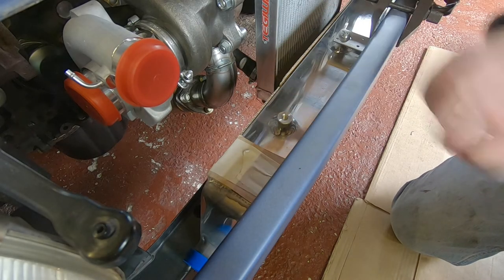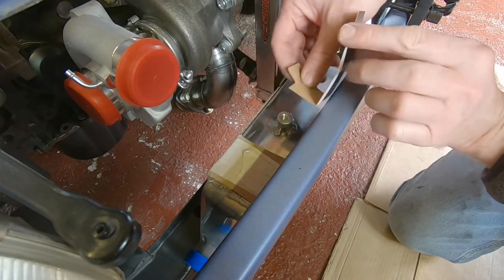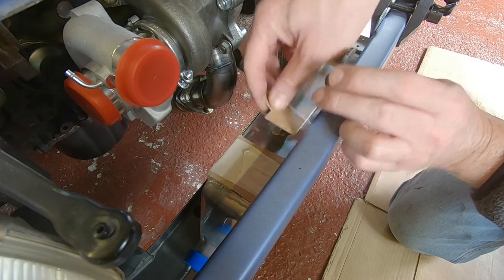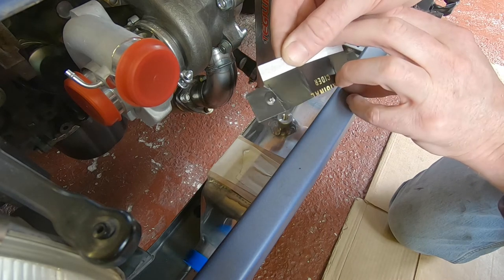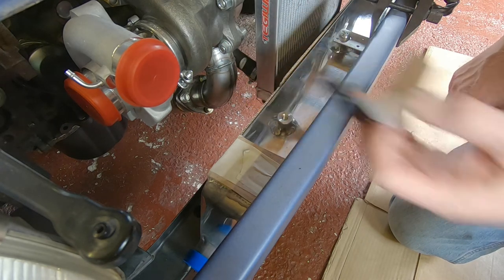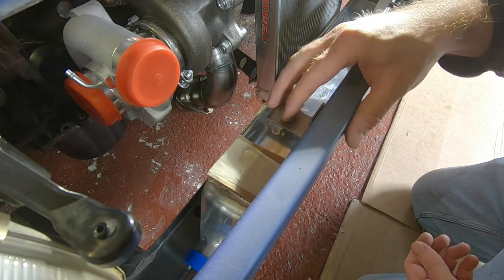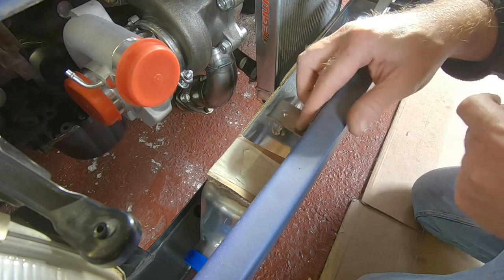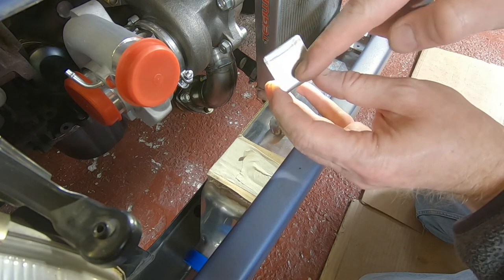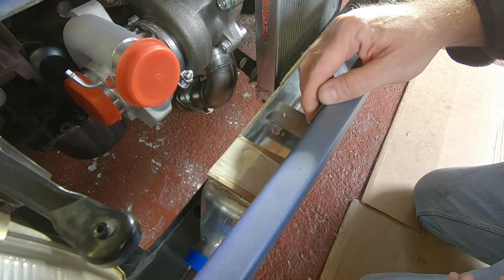Right, so we need to work out where the top bracket's going to be. I just used a folded piece of cardboard — sit that on the top of it and then gently push down on the cardboard till it marks the ring. You'll end up with an impression left on the back so you know the depth you need for your bolt. Measure that up — the cardboard template is fine. So that bolts up on that, and basically this section is about 30-odd mil, so 15 that way, 15 that way, and then we'll have our mounting holes to go in the front bar.